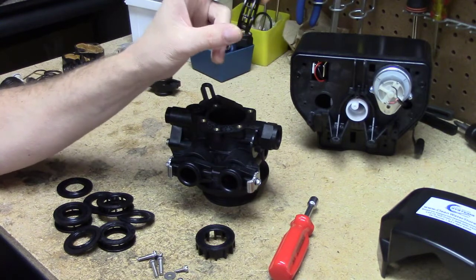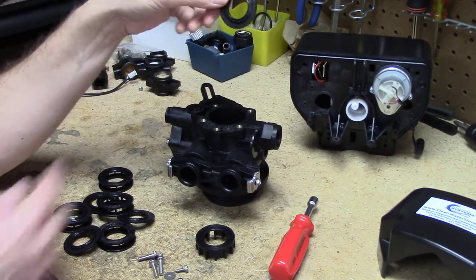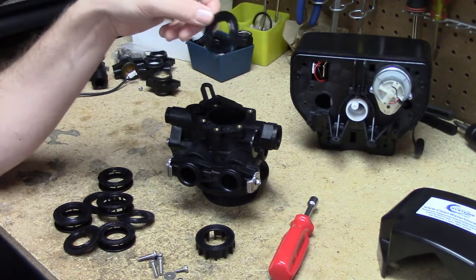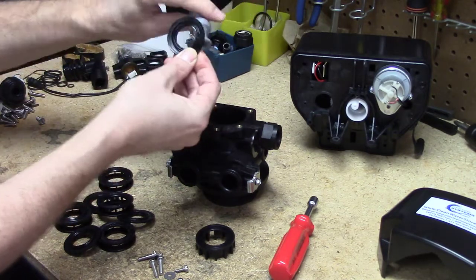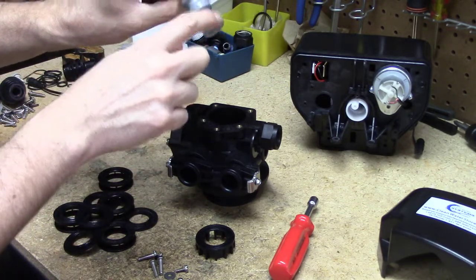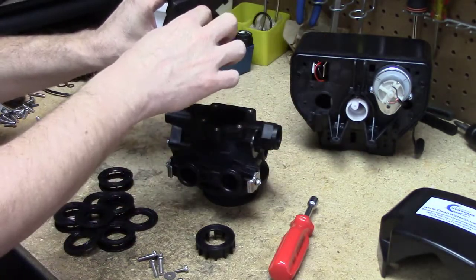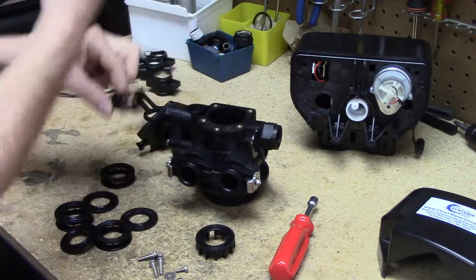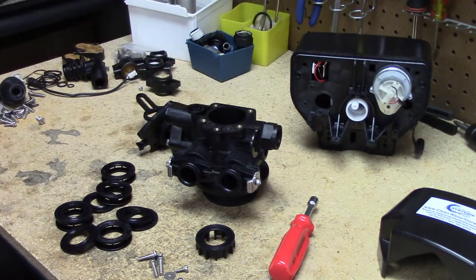The spacers can usually handle being reused multiple times until they finally wear out. The seals, however, should be replaced if the inside diameter is very frayed or worn where the piston travels through. If you see that, you'll also most likely see scratch marks on the piston — that's where raw sand, silicate, or sediment got trapped in a seal and spacer and scratched the piston as the valve moved.